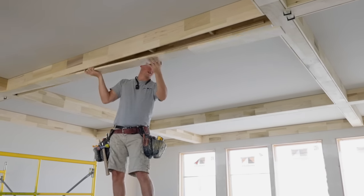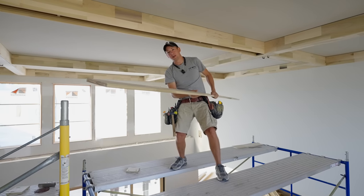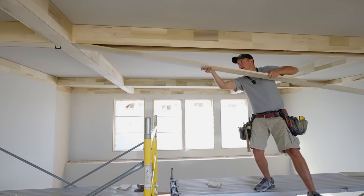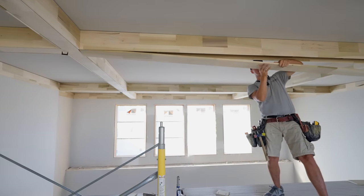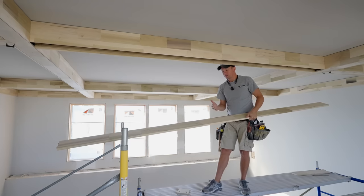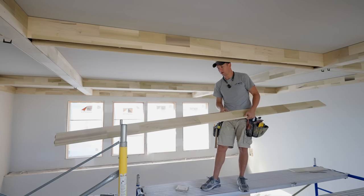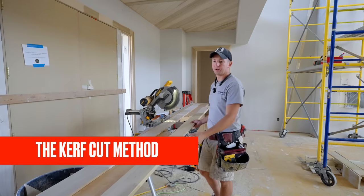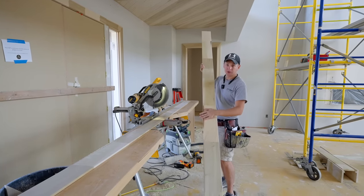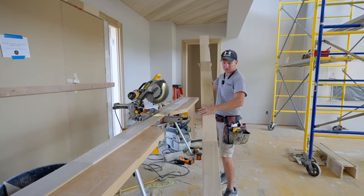If I'm going to put biscuits on this end and try to insert this board, I can't do it on the other end. Yesterday I did it a little differently — I used two boards so I could insert biscuits and then had a splice in the center that I sandwiched together. I posted that on Instagram and somebody shared a tip I've never done before. A lot of you probably thought: just flex the board down in the center to reduce the width enough to get the biscuits into their slots and snap it into place. This board isn't quite long enough for that and it's fairly stiff.